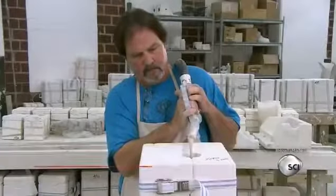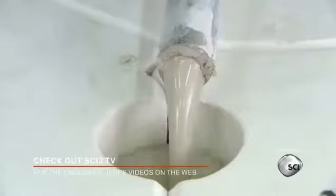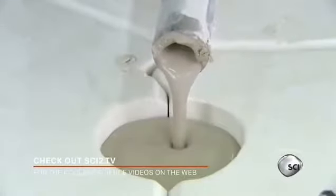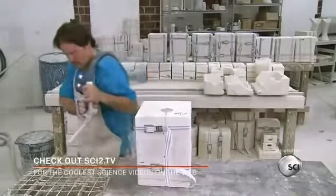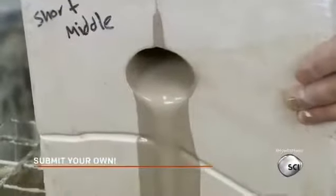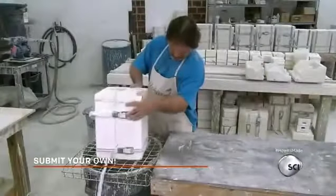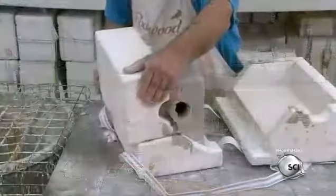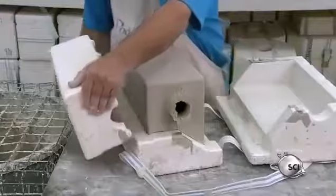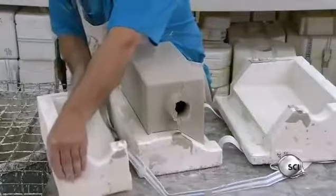When casting, they add significantly more water to the clay blend to produce a liquid clay called slip. They pour the slip into a plaster mold. The porous plaster gradually absorbs most of the water, leaving a layer of clay about 6 millimeters thick on the walls of the mantle-shaped cavity. After a few hours, they pour out the excess slip and open the mold to extract the cast mantelpiece.